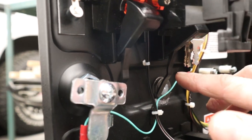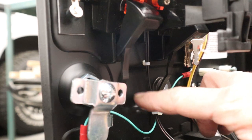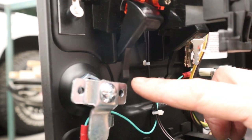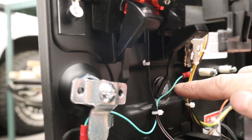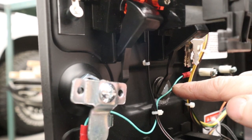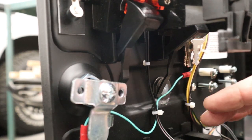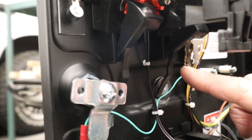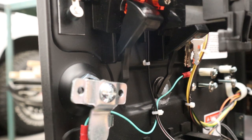So when you go to do this, what I ended up having to do is make the surface here that this plastic piece is on the same height as the original one that we designed our piece off. So I took some half inch flat washers, stacked three or four of them up, and then glue gunned it to the door to help make up that surface. That reapplied the tension onto the plastic piece and put it in the same spot, and then what do you know, the micro switch worked. So hopefully this will save you some time and energy when you do this on yours.